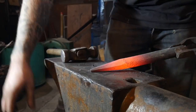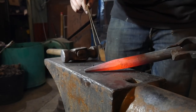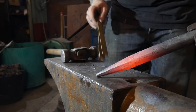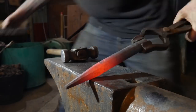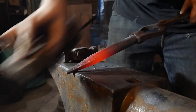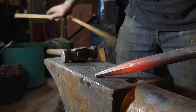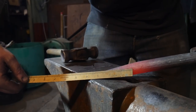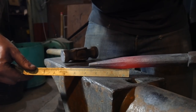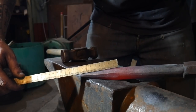Where people make a lot of mistakes with things like this is that they don't bring these tapers right back up to where the transition point is. If you make sure you do that, you'll get a nice taper without any setaways or lumps. There's our nice even taper — let me just grab the brush and give it a brush down, then grab the ruler. It's about three and a quarter inches there, which works out at about 85 millimeters.